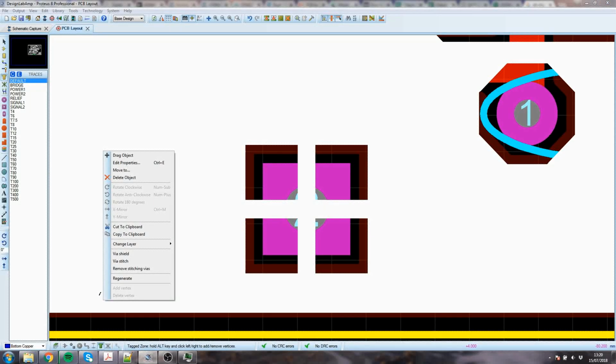So if you've got a, I don't know, 4-layer board or 8-layer board or something, and you've got buried vias and all God knows what, things that will cost you a lot of money to produce, it can get quite difficult. So you can turn off certain things so that you don't see them, and the other thing you can do is, if you need to see things but you don't want to be able to select them, you can choose which layer you're working in.